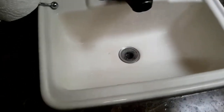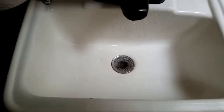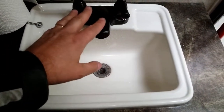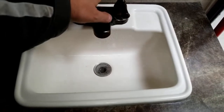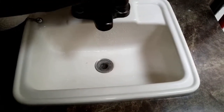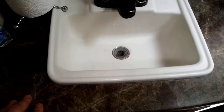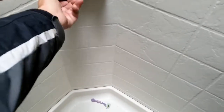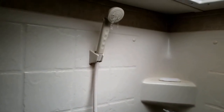I'm going here to the bathroom — you can kind of hear the air blowing through the lines. One thing I always make sure is that either the hot or the cold is always open at an appliance before I turn the other one on. It looks like no more water is coming out, so I'm going to go to the shower — I'm going to open up the hot, close off the other one — and you can see some of the water being blown out by the compressed air coming in from the outside.